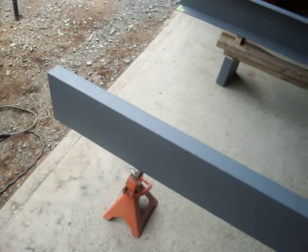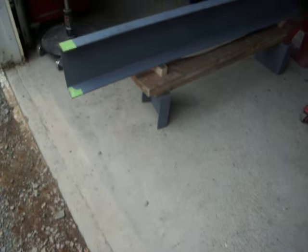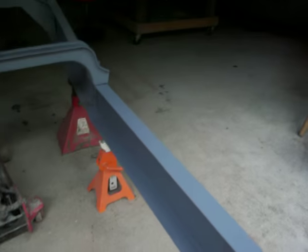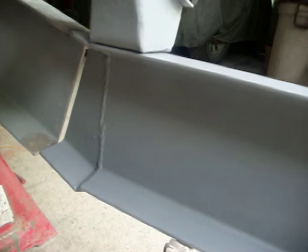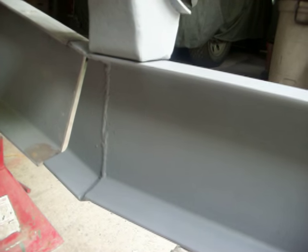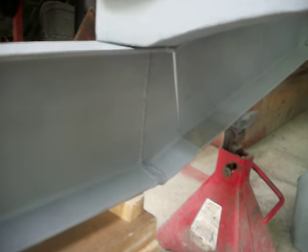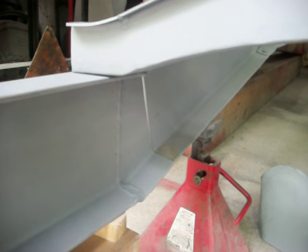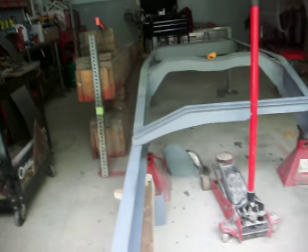I've cut these off already — this is where I want to end with these and they're not fastened yet, not welded together. Because it's an angle that opens, I have to grind a little bit there and bring that together. I had to weld that piece in on both sides to close in the gap for when I opened the angle up, so those are in place.